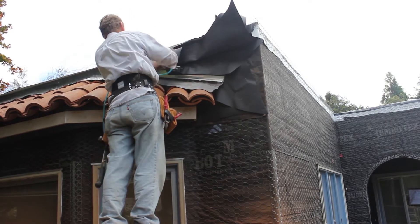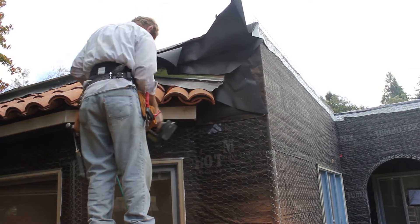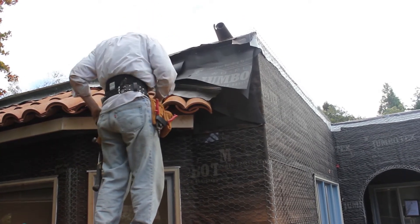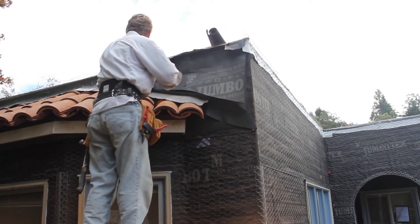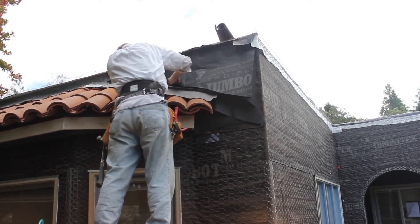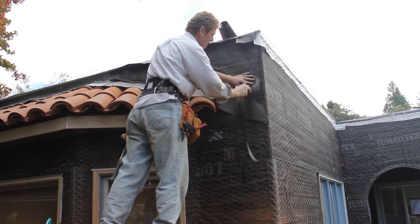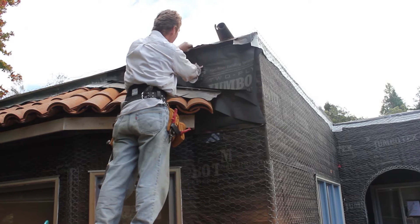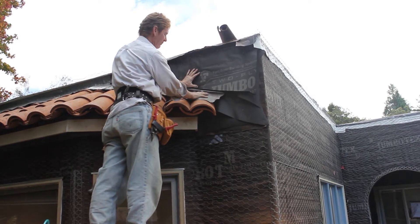We have our screed. I just put a nail there before the compressor starts to go on. Then we take all of the paper — let me get my knife out here. That's cut pretty well already. I'm going to cut the paper in the corner of the drip screed. When water goes through this — and it will, in fact we've been getting rained on today — it drips harmlessly through these weep holes and then hits the flashing here.